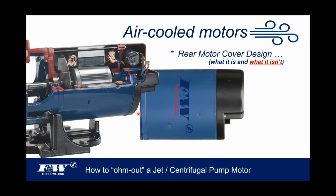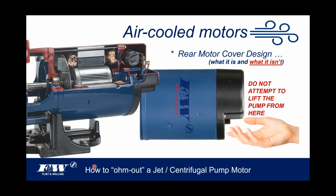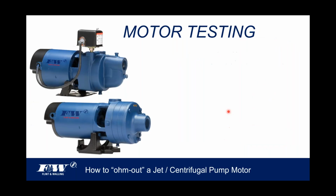What that rear motor cover isn't, if you see how it's designed, this is looking at the side of the motor, this is what it looks like. It was not, however, designed to be a lift point on the back side of this pump and motor assembly. I just want you to know that. It looks like it should have been, and it's convenient enough, but folks, I wouldn't want to trust a pump that's going to weigh 50, 60, 70 or more pounds that these two screws are going to keep that cover on the back of that motor. So I would hate to think that those things pop out of there for whatever reason, just because of the sheer weight. It's not a lifting point.